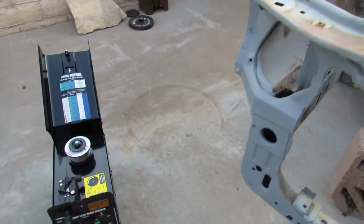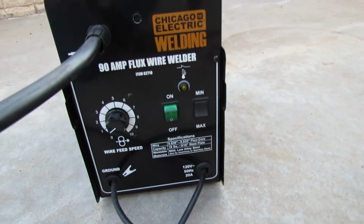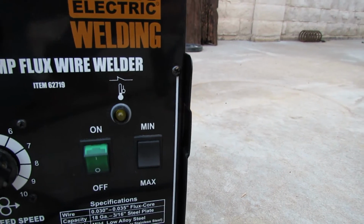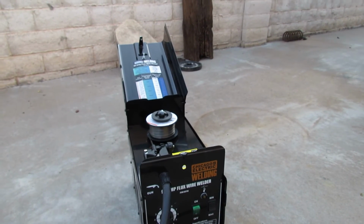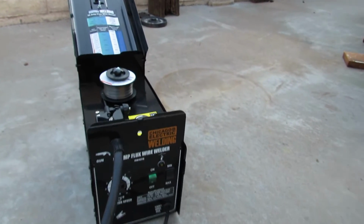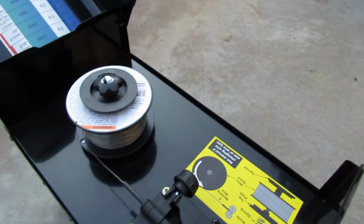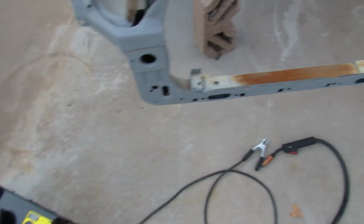But so I'm using the Harbor Freight welder, a popular one. I usually have it set for the thinner stuff around 2 or so. Right now it's about 1, so between 1 and 2. What I did was take my old sheet metal that I cut out and practiced on that to test it. And then the wiring, this is the third spool of wiring I've gone through. This is .035 wiring. I had the .030, but the .035's just a little thicker, and works fine though.